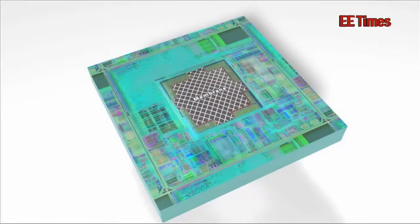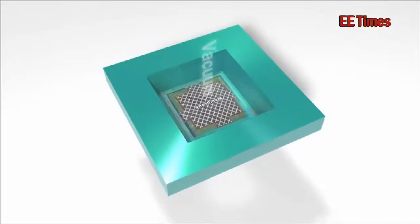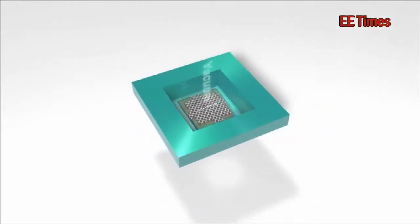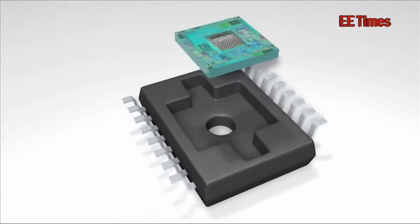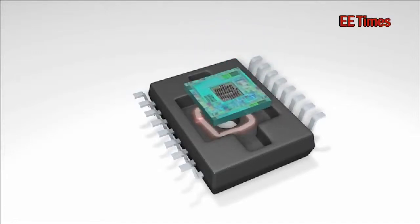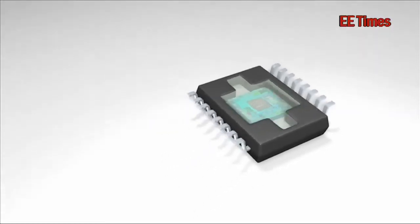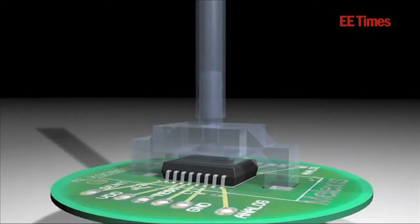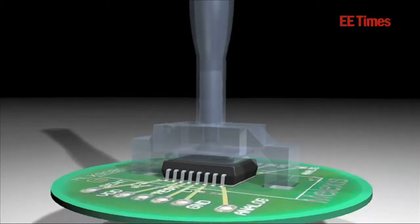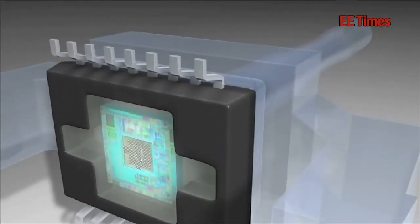What's the differentiation? Is it cheaper, smaller? Melexis has been producing fully integrated pressure sensors for more than ten years, but we've been only supplying them in die form to our automotive tier customers. Now we've actually launched it in a packaged form, and in this iteration, we're using an eight-inch wafer fab process and also a 0.35 micron fabrication geometry. So it's allowed us to shrink the integrated portion, the programmable portions, to a much smaller size and make it more cost-effective.